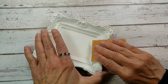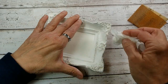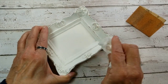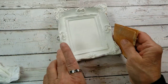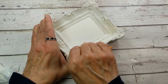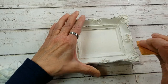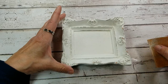A couple of things you can do: you can use the sandpaper, or with chalk paint you can also use a damp cloth and do kind of a wet distress. That will remove some of that paint as well. With chalk paint, when you wet it, it kind of reactivates it a little bit, so it can knock off some of those edges. But I wanted this to have a really soft, cottagey feel. I think that looks really good — I didn't want to go too crazy with it.